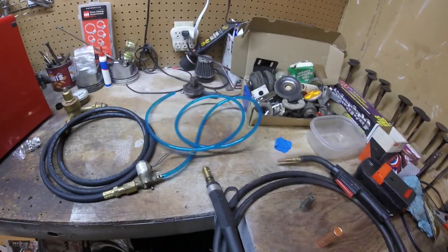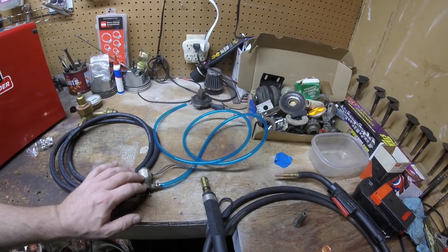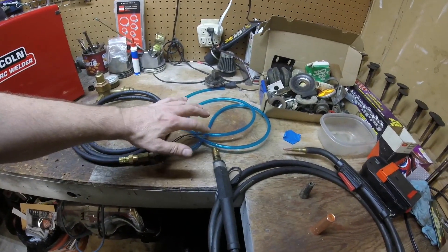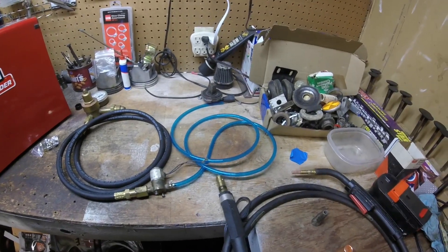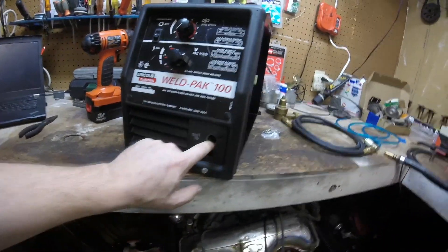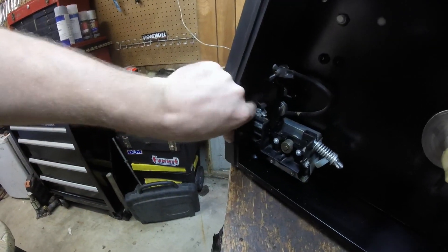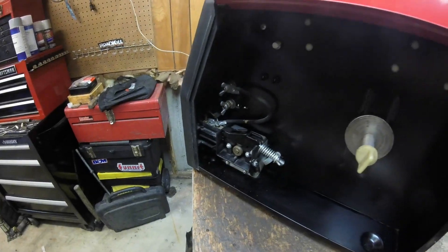This low pressure hose — the other end hooks up to the receptacle which allows the gas to pass into the gun. I didn't have the original hose that came with this, so this is actually 3/16 fuel hose, but it fits on there nice and snug. Since this is not pressurized in any way, all you really need is just a good seal to direct it to where you need to go, so this should be sufficient. You can see this plugs into the front here — this little gas inlet is where the hose attaches. But first we've got to get this thing apart so we can get that installed.